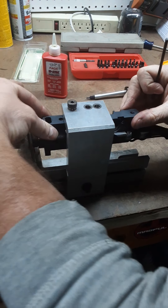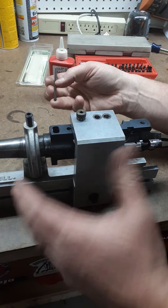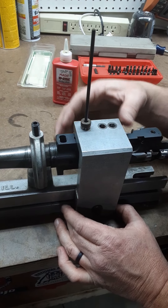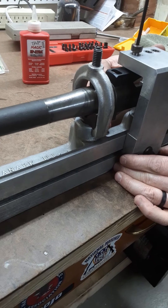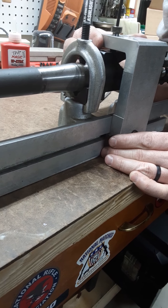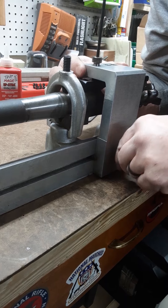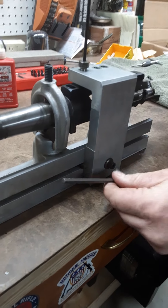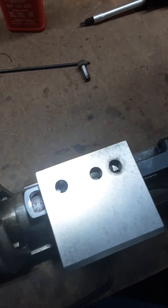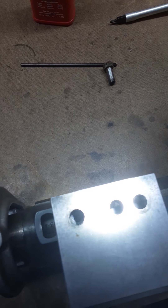The next thing — you mount your one screw, get your mount in, and then you move your jig to locate. If you have one of these jigs, there's a center finding tool. I don't have it, so I just use a transfer punch through this bushing. You just kind of move your jig over — you'll see it drop when it finds the hole. It doesn't have to be super precise, there's a lot of slop, but go for a perfect job. Then you snug down your jig and eyeball down in there to make sure it's all lined up. You can see how those are concentric circles, and that's good.